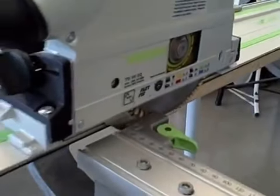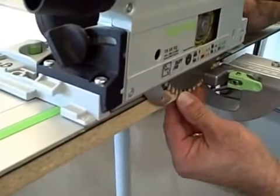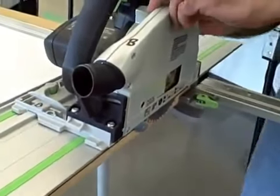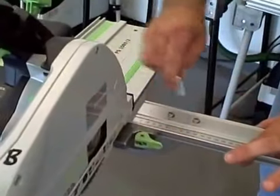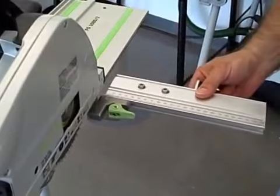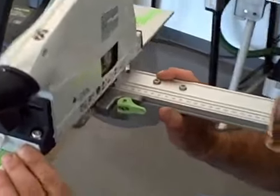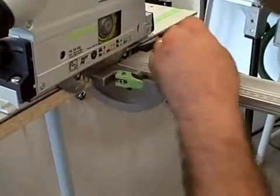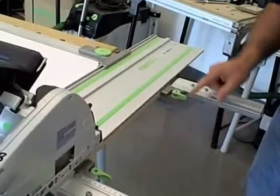So I'm going to take it to the next one. Remember that tooth I had — X right there. See how it's a little tight right there? So what I'm going to do is right in here — I always have a tool on board on my saw. That's reading zero. I loosen it here, I loosen it here, so I have plenty of room. I'm calibrating — I take it and I move it right to X. There it is right there. So that guarantees from point A to point B I'm dead on accurate. Once you tune this in, you're good. That's my calibration — calibrated here, calibrated here. I'm ready to cut.